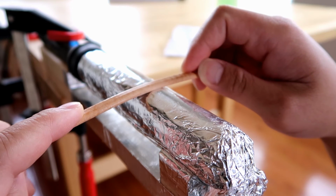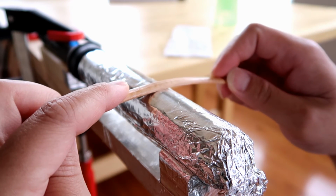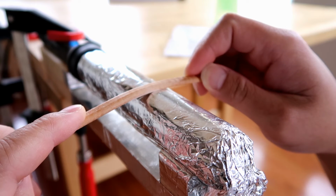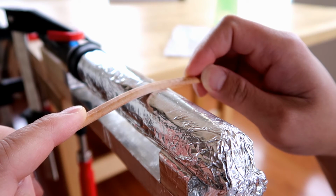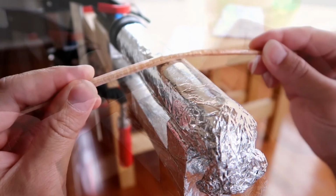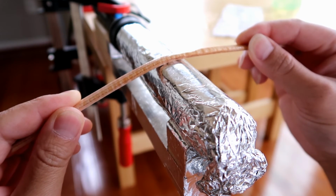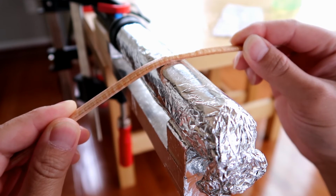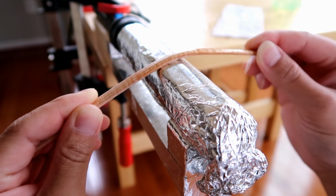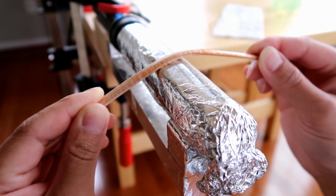It's got a little round over edge because I'm actually using this as the braces inside the sides. I didn't have any other little scraps, and I didn't want to bend my actual binding yet, because I want to take some time and do it right. But it gets the job done. Just slowly and steadily, work it back and forth, work it back and forth. One little tip, if you're new at this, like me: once the wood actually gets up to the temperature where it wants to bend, you can feel it give under the weight.